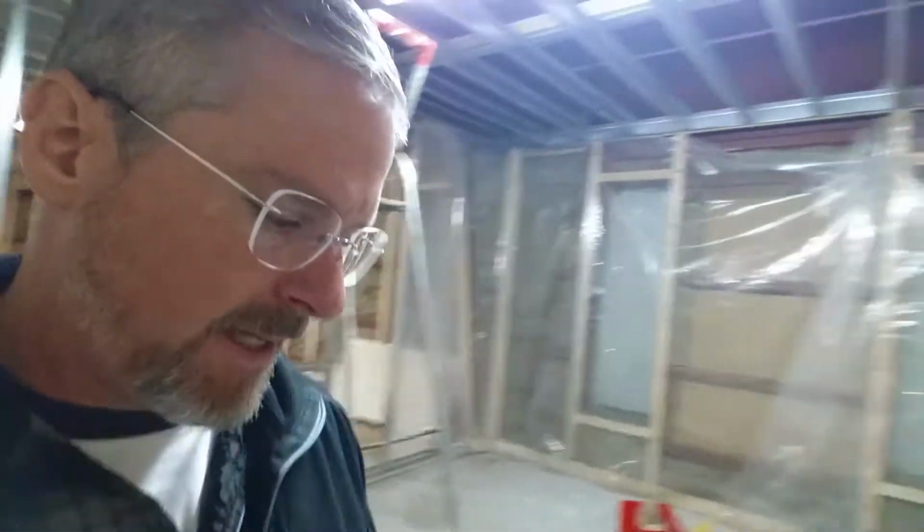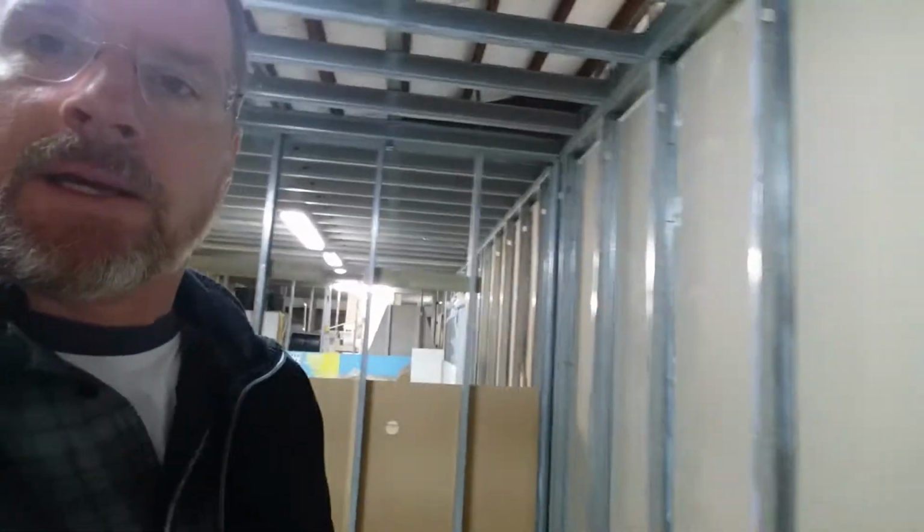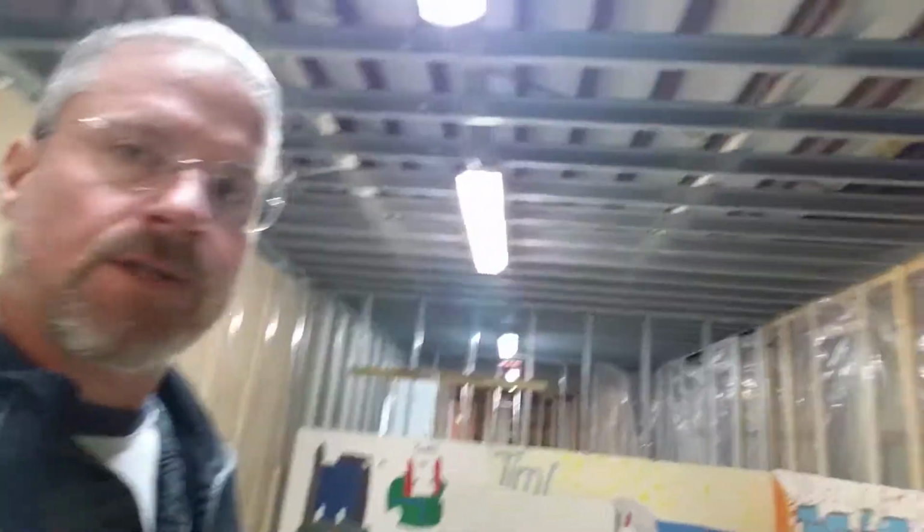This is room H5. Walking down the hallway from H5 into our second room, which is a smaller room, this room is going to require 16 sheets of drywall on its walls and 9 sheets of drywall on the ceiling. And again, same plan: conduit in the walls, and drywall on the ceilings and in the walls. As we start getting the drywall in, mudders can follow up. I don't know the experience level of all the people coming, but we can have mudders start right away as we begin this process.